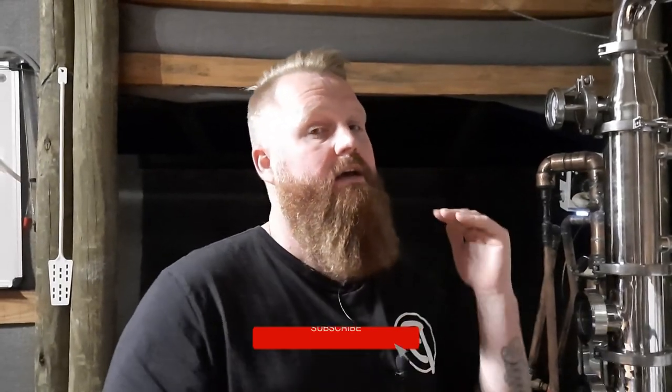After running the still for the first time I noticed I didn't get the ABV I initially thought I would get with six plates. According to the VLE chart, with six plates I should be able to get around 94%, but I only managed to get 91%. That doesn't sound like a big difference, but it was significant — to reach 94% I would need to add an additional two or maybe even three plates to this column. So let's explain how the different sections of the previous run differed and how I calculated the efficiency.